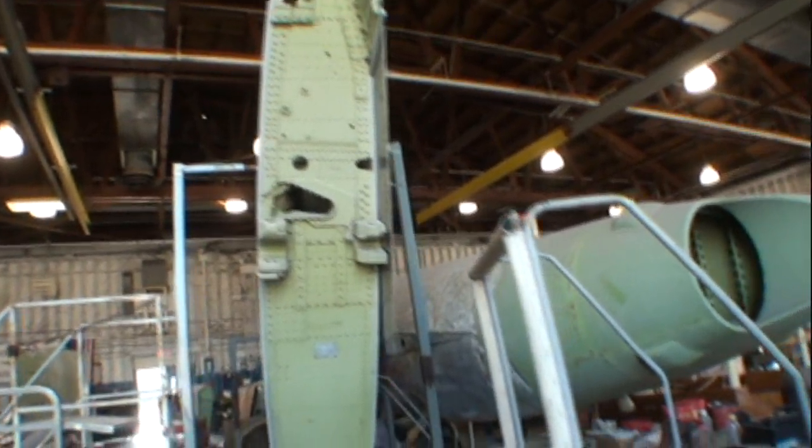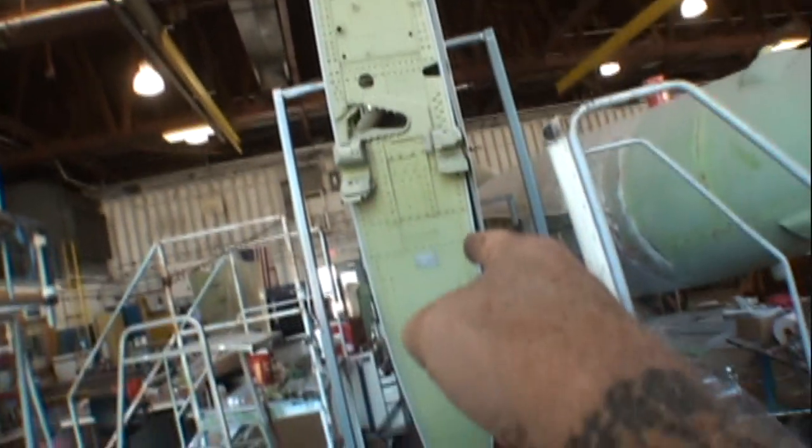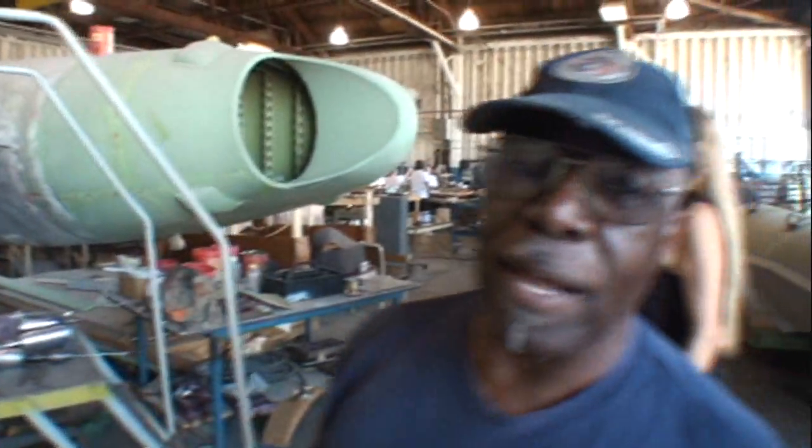So what are you working on now, Watt? Okay, so you're putting the sheet metal on the wing. Is that aluminum or is that cloth? Aluminum. So you're skinning the wing, and then is that going to be pop riveted on when you're done? Yeah, it'll be screwed on. I put them on with screws. Now, do you use some kind of special screw that doesn't vibrate loose? Well, the nut plates I put on there are anti-lock nut plates, so it won't vibrate loose. Plus, all the panels will be sealed on.